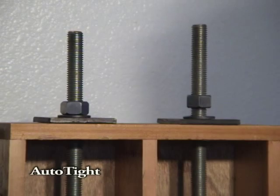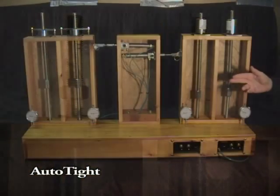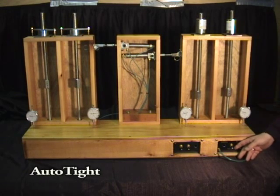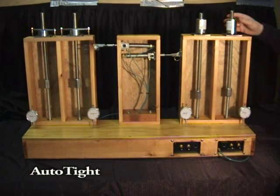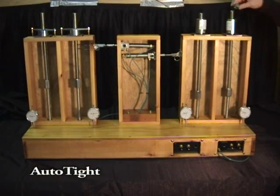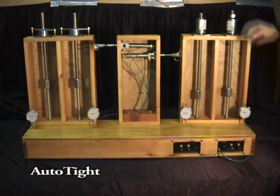And while the building settles, the threaded rod length is constant — the connection length stays the same. To compensate for settling, self-adjusting shrinkage compensators have been developed to keep walls tight. This demonstration series compares loose versus tight walls with and without shrinkage compensators.